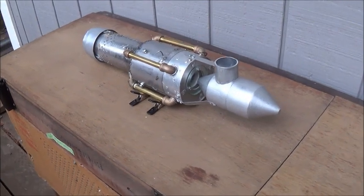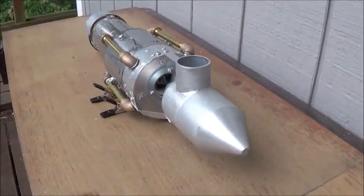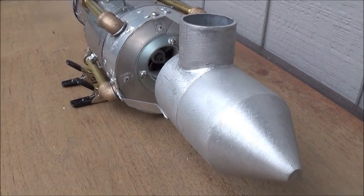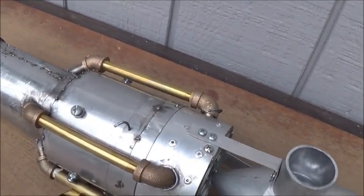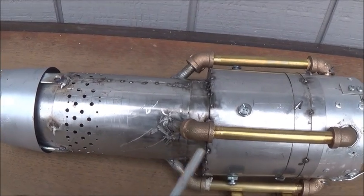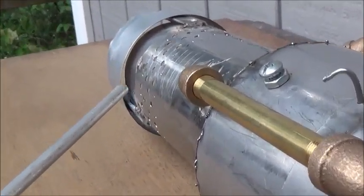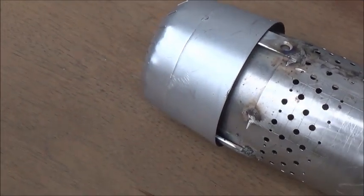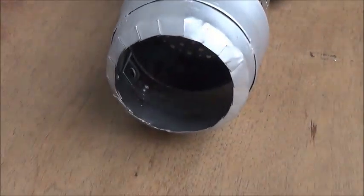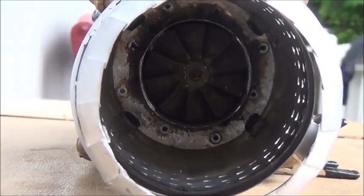Let me quickly walk you around the engine so you can see it — give you a view looking down the entire thing. You can see the intake right here; if I zoom in inside of there you can see the intake fan. We have the turbojet engine portion right there, we have the ramjet engine portion here, our afterburner, and our tertiary opening. Let me give you an angle so you can see the air draw gap between our reduction collar from our ramjet engine to our tertiary reduction collar here. There is a secondary reduction collar end. Let me give you a look up inside the engine so you can see the drive fan — the air intake is there from the bypass tubes.